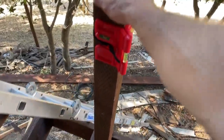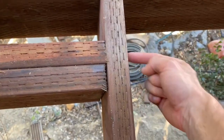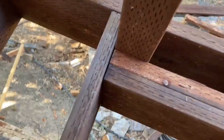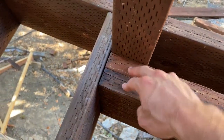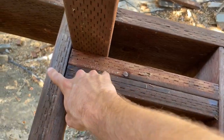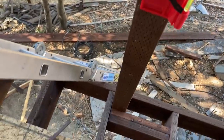Finally we have our end posts. The force we're trying to resist is someone pushing off this way, and these are the simplest. You take two of your 2x10s and come in with your 6-inch structural screws — two per board, so four on each side — and then you drive two 8-inch screws through your end joist, the 4x4 guardrail post, and into these two blocks. As you push, it's trying to rotate the whole thing, but it's being resisted by the blocks as well as your joist, so all that load is transferred to make very strong connections that are safe for people.